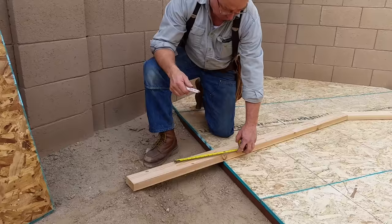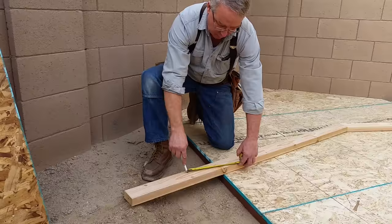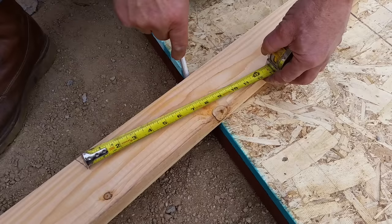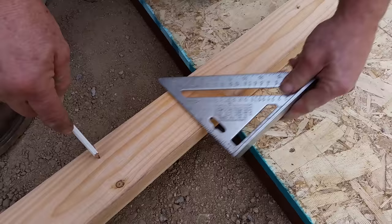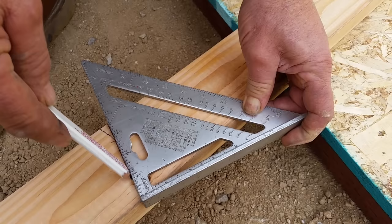We're going to use an inch-and-a-half fascia board. So to net a 10-inch overhang with an inch-and-a-half fascia, we're going to cut these off at 8-and-a-half inches from the edge of the diaphragm — the floor diaphragm — to the edge of the overhang. We'll get out our speed square again, set 3/12 common rafters, and scribe it. There's our overhang.